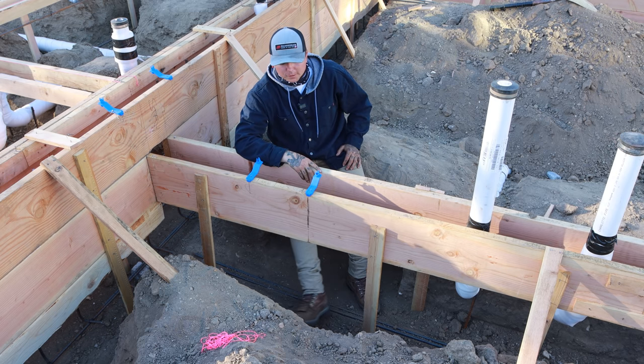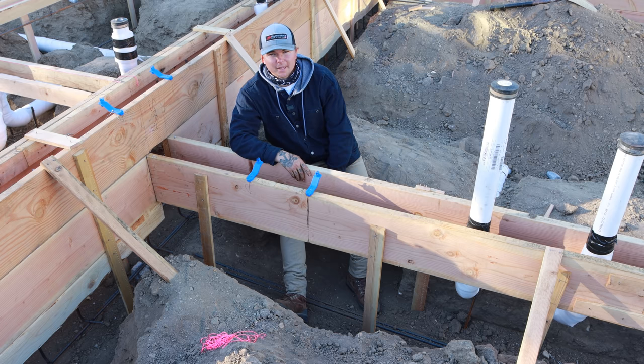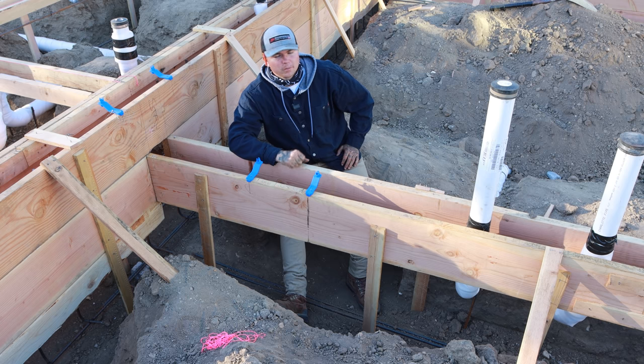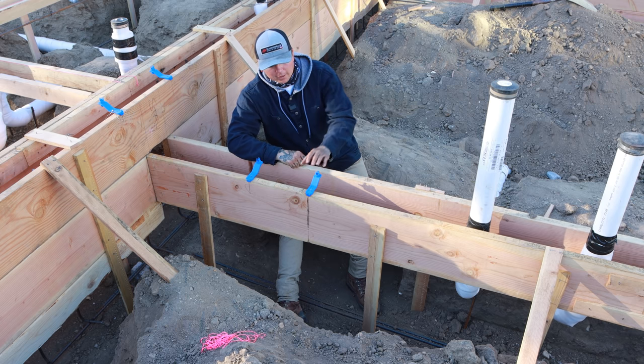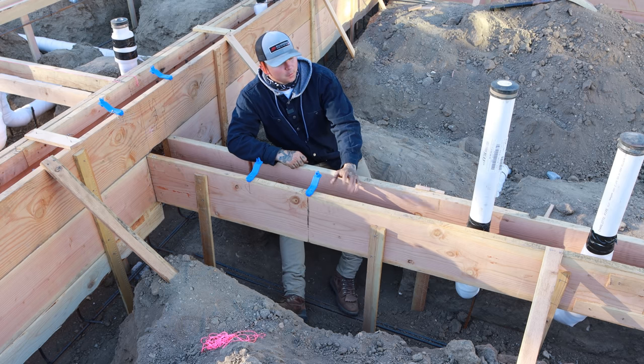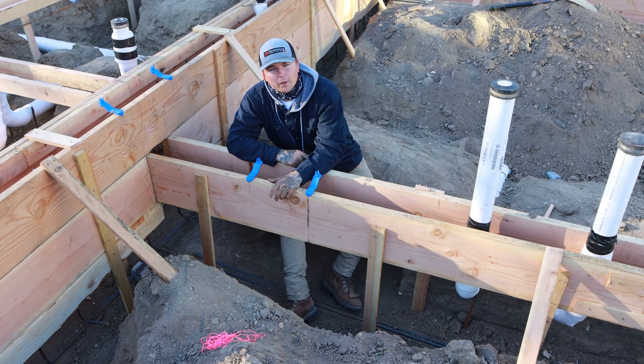We still have a couple areas where rebar needs attention, such as the spread footing that I'm sitting in here. We'll have a mat down here at the bottom of the spread footing, bars running both ways, crossing over each other. We'll talk more on that tomorrow. Along with all of our embeds, I'll show you guys a few tips and tricks for those. Along with that, we're gonna go over a few things that most people miss. They're spec'd out on the plan, such as your 3x3 plate washers being within a half inch of your shear wall. We're gonna go over that and more tomorrow.